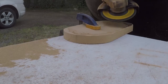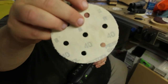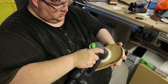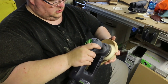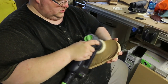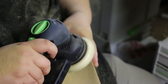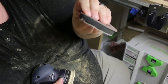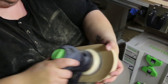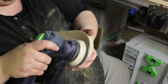You'll notice that the inside surface right now is quite rough, but we will refine that shortly. Using 40 grit paper on my random orbital sander, I start sanding the inside to get rid of the rough texture left by the flap wheel. From 40 grit I move up to 80 and 120 and then start using an interface pad, which is a foam pad — you can get these for a lot of different sanders including standard 5 inch random orbit sanders, and it helps to conform to the inside curves of the model.